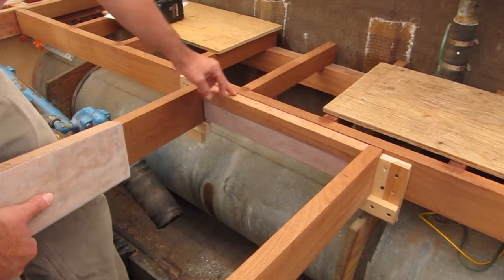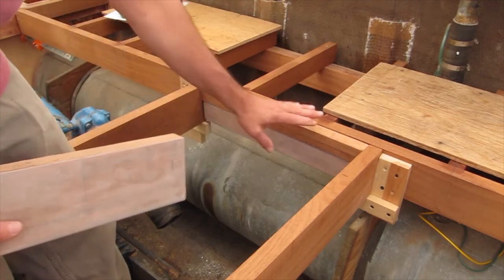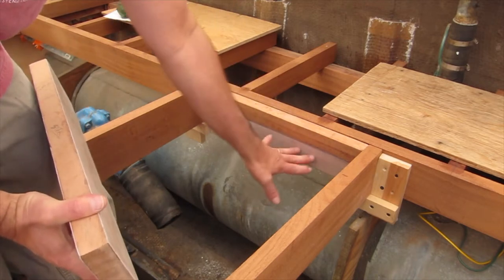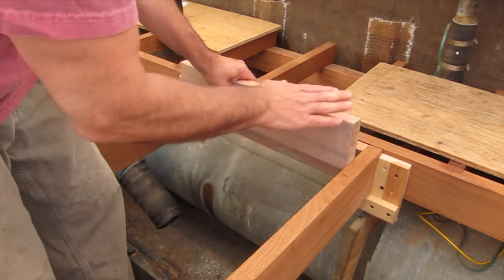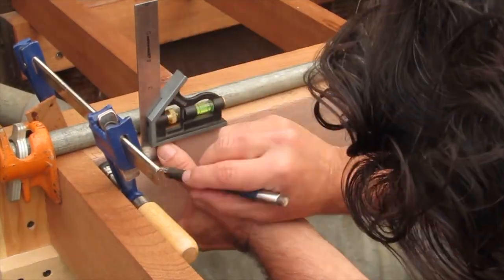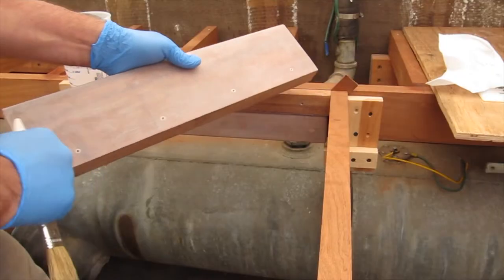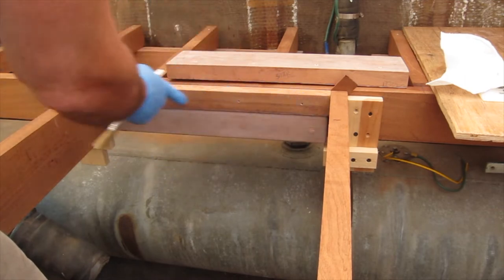We have this piece here, which is going to be attached to the beams coming this way — probably put a screw right through on the ends, but that's not the only piece. That piece is resting on this other piece that I put in the other day, and that's what's going to hold the whole thing from going down. But to this piece and along this face to actually bolt everything together, this is the other piece here. It's a pretty tight fit right now — this piece basically slips down and then this top will be flush with this piece. I marked this with some pencil so I know how far to apply the epoxy on that, and then I'll do this wood surface right here.